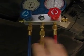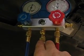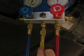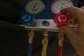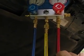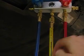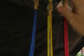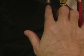This is the high side — the red — and this hooks to the low side. This is the vacuum down to the pump over here. Make sure that the lines are all on or open for both your high and your low side. With that vacuum, it is drawing this way: from the high side it's being sucked up and down, and your low side is getting sucked up, over, and down. So you're putting a vacuum on your system.